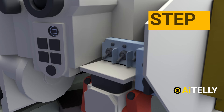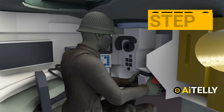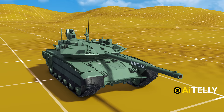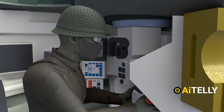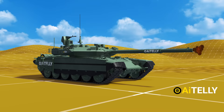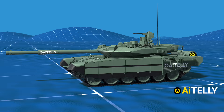Let's see how this works step by step. Step 1: turn on the fire control system. Step 2: turn on thermal imagers. Step 3: the gunner loads desired rounds using the auto loader function. Step 4: he finds the target using the laser rangefinder and moves the turret by tilting the joystick sideways to rotate the turret left or right, or tilting vertically to move the turret up and down. Step 5: after verifying the target from the thermal imagers, he fires the tank using the right trigger — opening fire with this 125 millimeter gun. Step 6: if he wants to fire the coaxial gun, he presses the left trigger, opening fire with the machine gun located at the front of the turret.